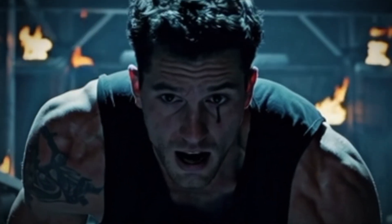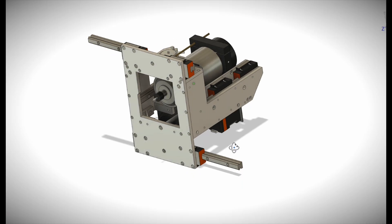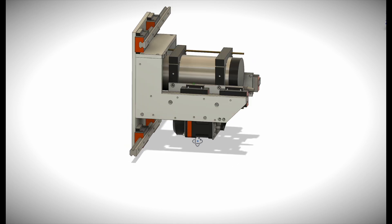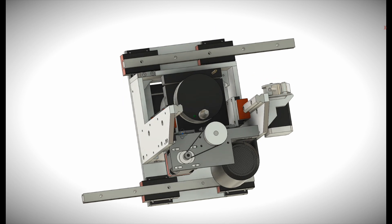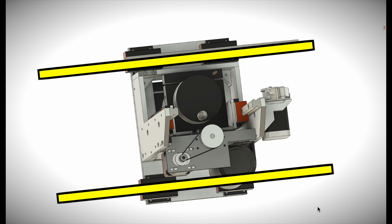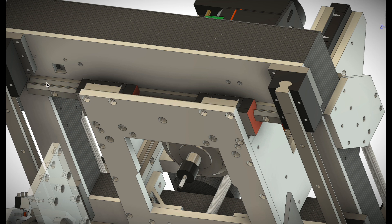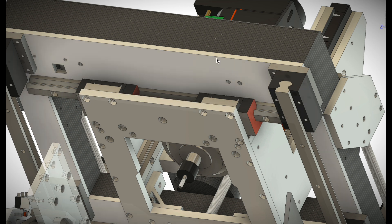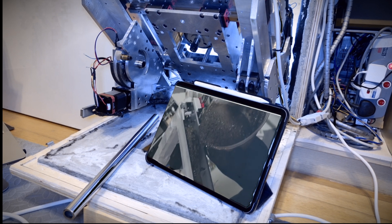Oh mighty queen of hell, Angel. Let me explain it once more. First, I built the Z-axis — since it's made only of aluminum plates and angle stock and it's relatively small, there were no major issues. Next, I mounted the linear guides for the X-axis and attached them to the base plate of the carriage, adjusting for parallelism and alignment. I fine-tune everything at this stage to ensure the required precision. Then, by casting it in epoxy granite while everything is properly aligned, I can guarantee that the necessary precision is maintained. Normally you'd machine the parts with high precision, but here I'm locking everything in place after fine-tuning it first.